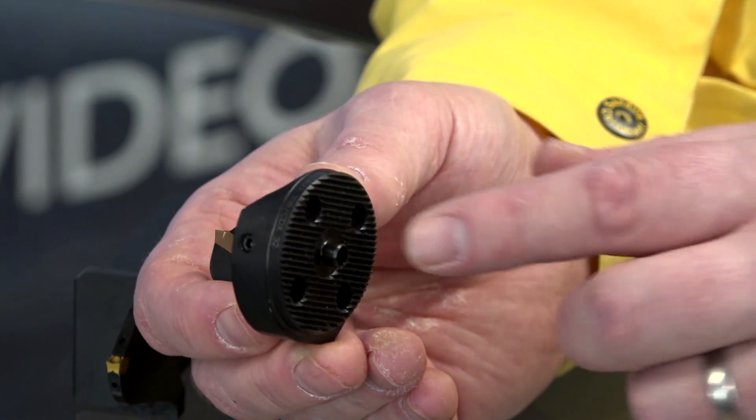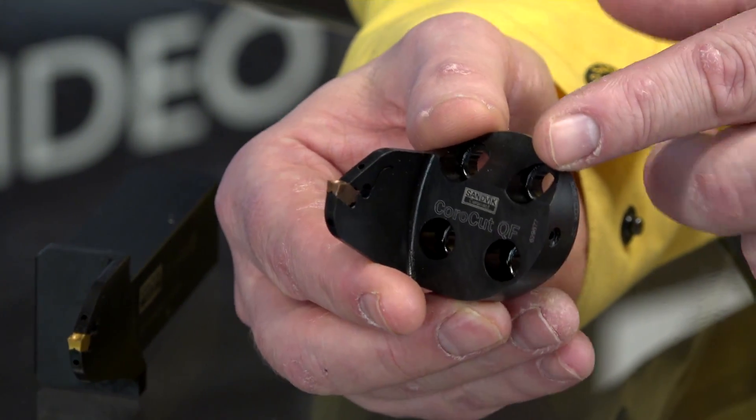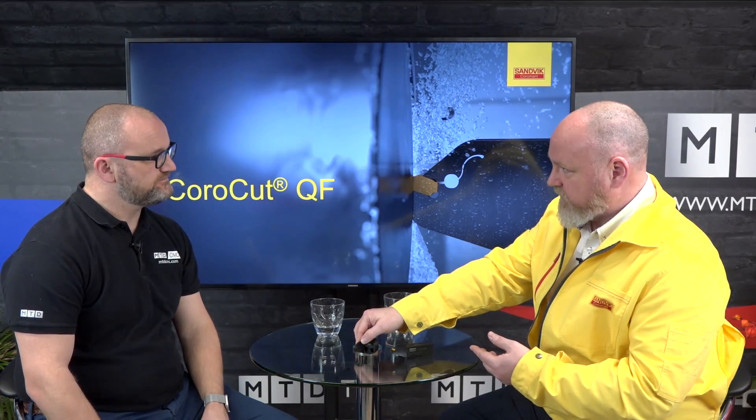You can see a much bigger cross-sectional area for support, and all of this means we can go much deeper with face grooving as standard. Looking at the SL serrated lock coupling, we now have the coupling on the back of the tool rather than on the side as it used to be. This makes torque transmission through the tool much better, and as a consequence we can now put it onto a tuned or damped boring bar and machine face grooves deep down without any vibration.